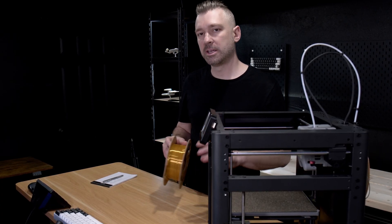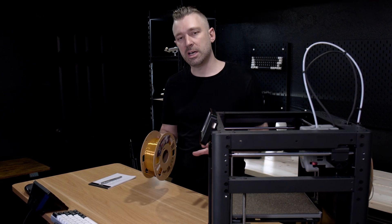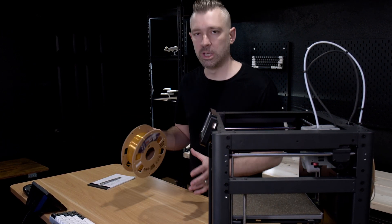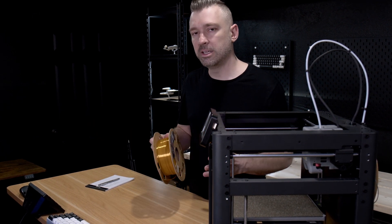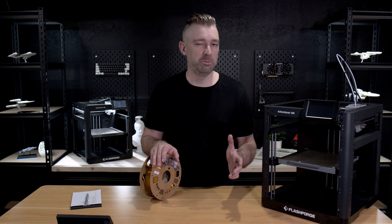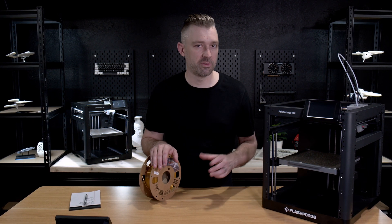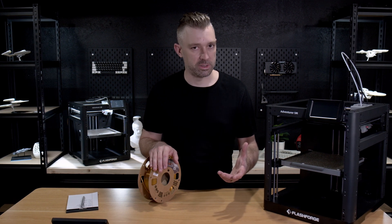The caveat is that a lot of people you see on YouTube, TikTok, or Instagram are printing parts so fast that open filament isn't sitting long enough to collect dust and become a problem. But outside of that, I've seen people have open filament on a shelf for over a year and then wonder why they're having printing and adhesion issues.